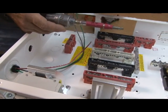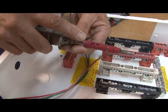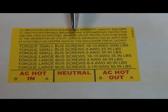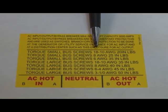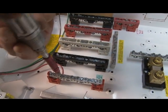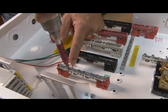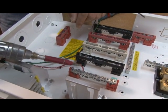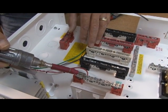You can see I even mark my own wrenches — we don't want to make a mistake. You want to be real certain that you have the right torque on these, and I've got this one marked at 20. This is the one I use for my breakers and my lightning arresters. As you can see inside the e-panel box, we show the torque specifications. We're working with 12 gauge wire, shown from 18 to 10, and we're working at 20 inch-pounds. I tighten it down, give it a double click. In about an hour, maybe an hour and a half, come back and double torque it again — you want to make sure these are nice and tight.